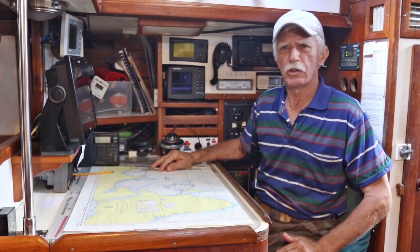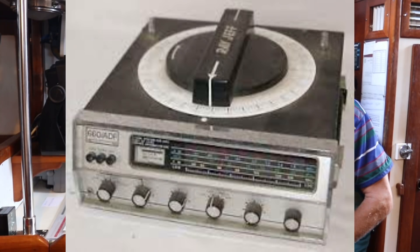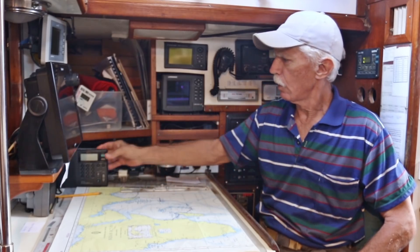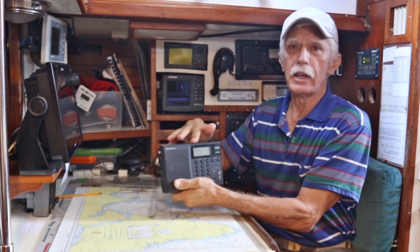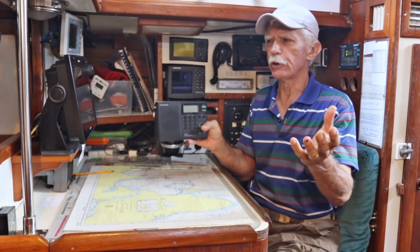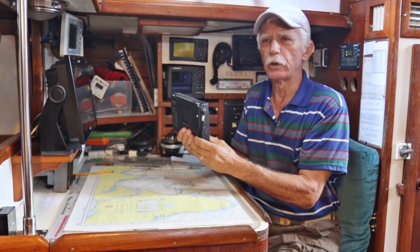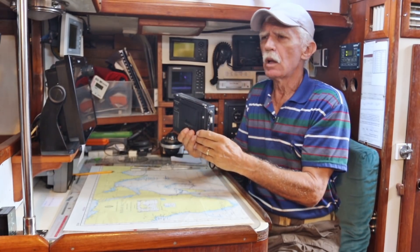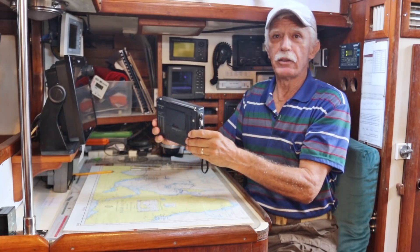The other antiquated piece of equipment we don't have is a radio direction finder. I used to use a RDF like this one — on top is a ferrite antenna which rotates, and you rotate it to get the null from the station you're homing in on. These days what we have instead is this Grundig shortwave receiver. Inside it is a ferrite antenna; I tune it to the AM band, pick up a station, and rotate it to get the null — the least amount of reception — so we know the station is either that way or 180 degrees in the opposite direction.